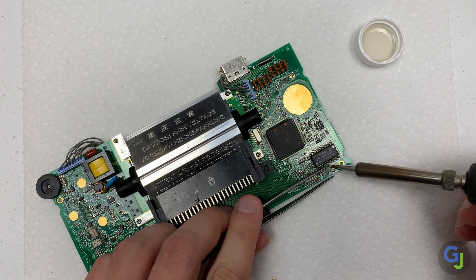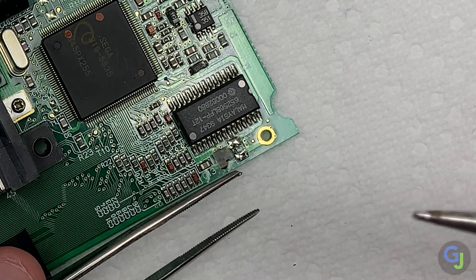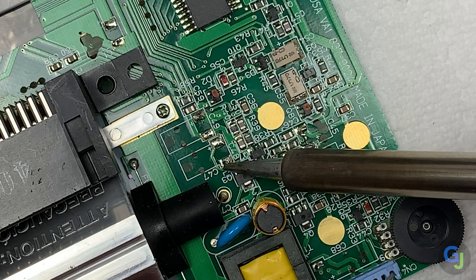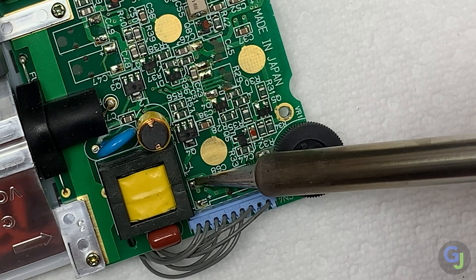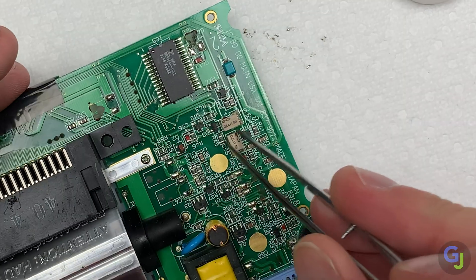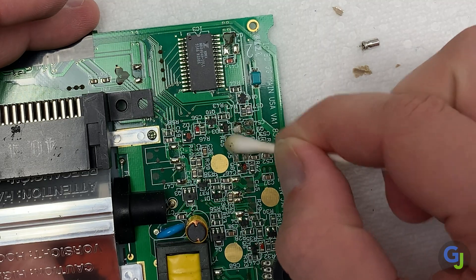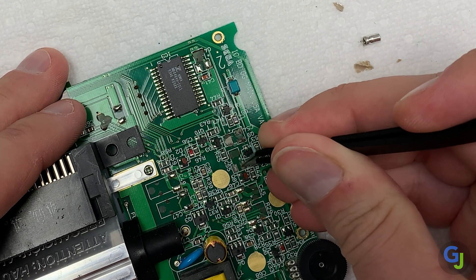After cleaning, I'll go back and remove any of the old cap legs still soldered to the pads, while also adding a little new solder to each of the locations too — this will aid in the install of the new parts. I'll come back to the tan colored ones in a bit since they look like they may need some additional rework. The solder around the tan caps is looking a bit gray and dull, so I'm guessing these were the reason the screen isn't working well. I'm going to remove these in the same way as the others, but with some additional cleaning steps like scraping the top of the solder to remove the tarnish, and using some extra flux to clean the area while adding new solder to the pads.